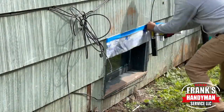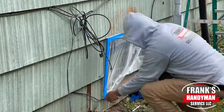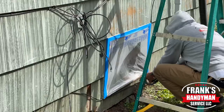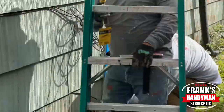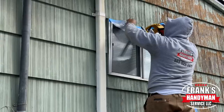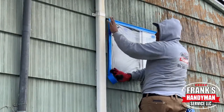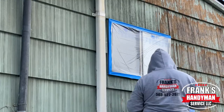In order to apply the masking, it's pretty straightforward. We have a hand masker right there. We start off at the top and then on either side we just have a little roll of blue tape, and we're just taping it on the face of the trim around the window. Once you do that around all four sides, that's pretty much it, and the rest can be painted — no problem — especially because later we're going to go ahead and paint the trim with a hand brush or with a roller.